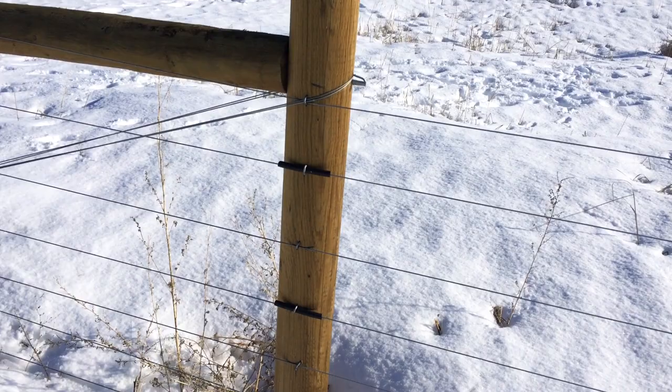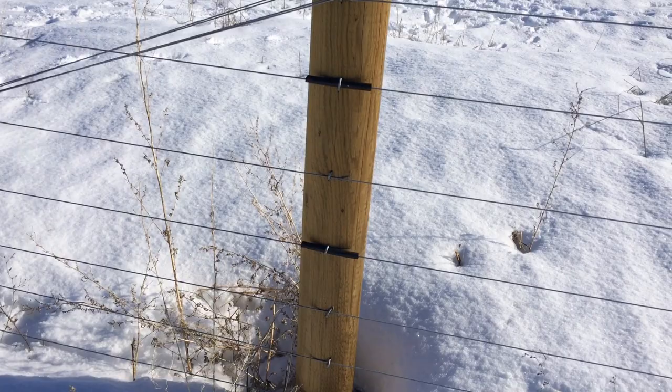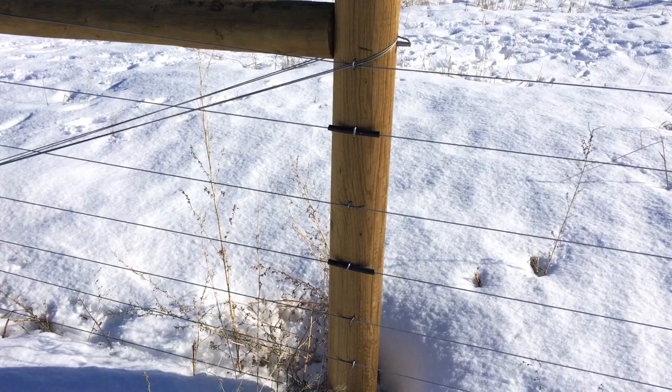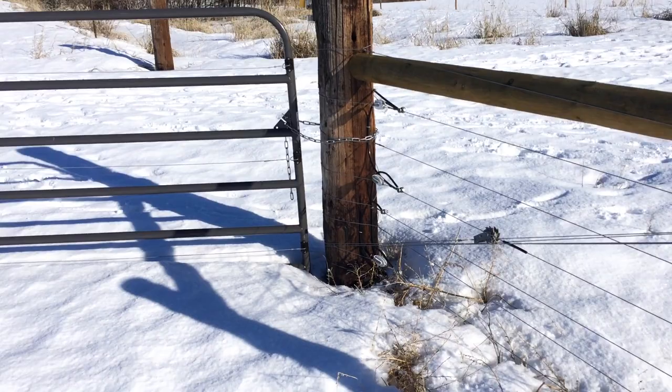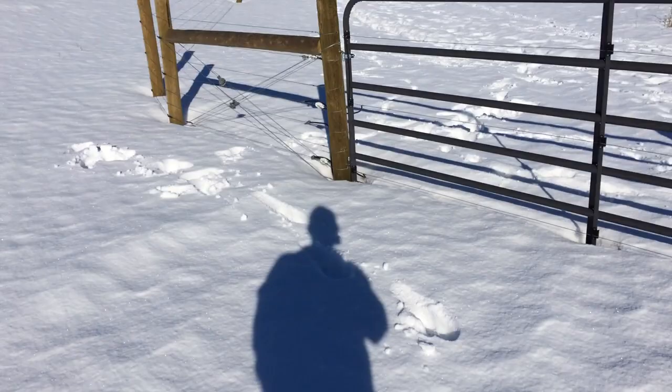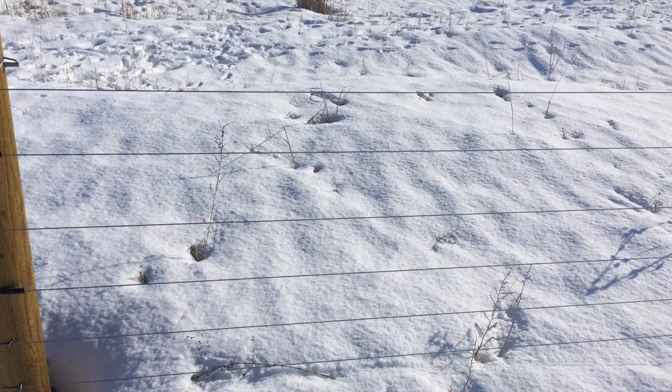On high tensile, the wire slides under the staples — you don't staple it tight against the posts — and you put the staples on the inside of the field. The idea is that if your cow is pushing on the fence, they're not just relying on the strength of that staple; your cows are basically pushing against the post. There are exceptions, like when you go around an outside corner, but then the cow is really fighting the tension of the wires to get through.